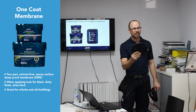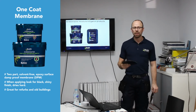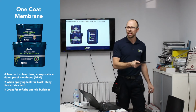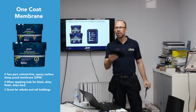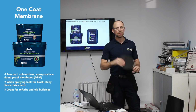How do you know you need this? Ask about basements and things like that. When they ring up and say, I've got quarry tiles on my floor, what should I do? How old's your building? First question. I've got crunchy Marley tiles, thermoplastic tiles on the floor. How old's your building? I've got bitumen adhesive on the floor. How old's your building? They all highlight that it's an old building. As soon as you hear those sorts of things, that's where you want to start speccing this.